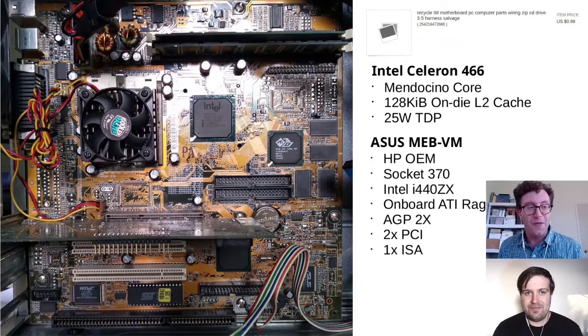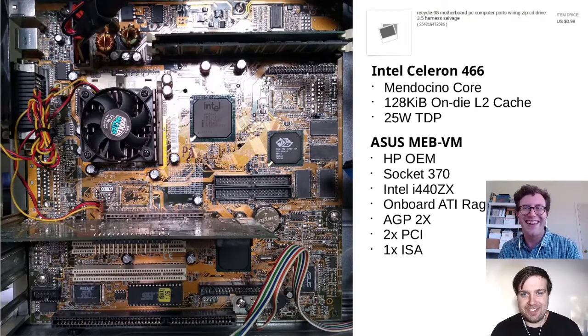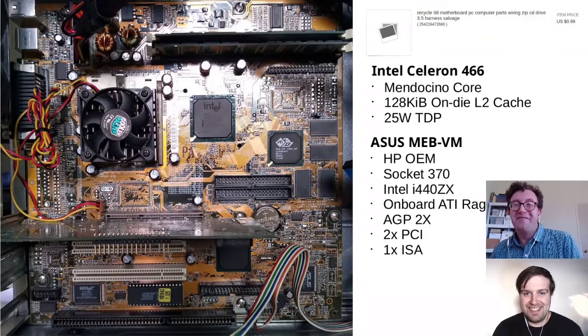And what I learned from the forums is that attempting to flash the stock ASUS BIOS on top of this board will brick it. So it would be a $4 machine. So, yeah, that'd be bad. Yeah. So it's got some high points. All the capacitors were in good shape. They're legit Japanese Rubycon caps. And generally speaking, once I resoldered all the important stuff, it's still missing a few things. But once I resoldered the important stuff, it's working.